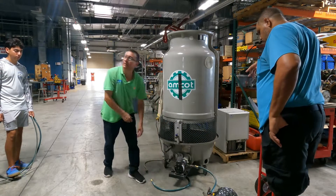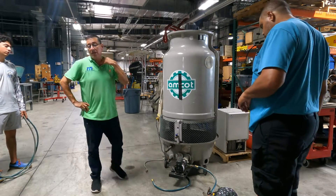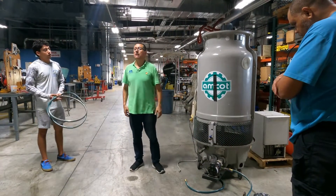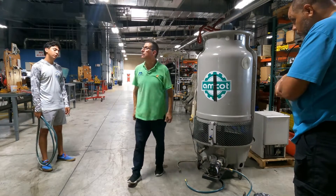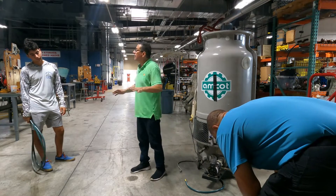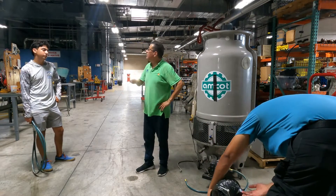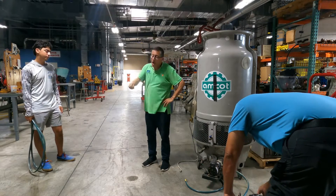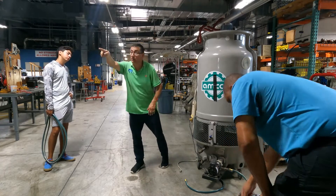In other words, if I am inside the boat and I need to connect the cooling tower, I need to identify where the input is — the unit will be running exactly the same as when running in the boat. The only thing you need to disconnect and reconnect is the input of raw water and the output of raw water. The rest of the unit is operated via the AC panel with the breaker.